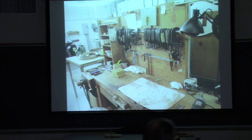No, it doesn't show. What I do when I drill down into that fret slot is I actually rock the drill bit slightly while it's spinning, back and forth along the slot line, and that makes it just big enough for my needle to go in there, because I just don't want to have to touch it up. What Martin does, because theirs is so big, to cover the hole, they take a piece of ebony and put it into a pencil sharpener, add a little glue, bang it in, and then trim it flush.